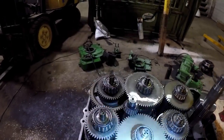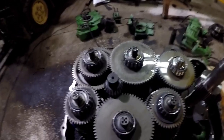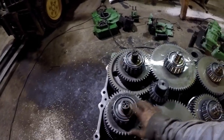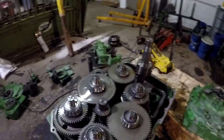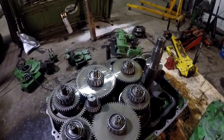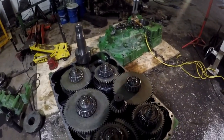If not, I've got an idea. I could make a - I've got a big piece of four by eight half inch plate. I would measure all these off and make a plate that would sit down over all the male ends of these shafts. Then I'd build a latch that would go right in the grooves right here. I'd tighten the latches down on each one and then put a lifting hook in the middle and lift all the shafts out at one time. This is a typical Funk transmission - Funk loves using tapered pressed-on bearings on everything. So our little bearing tool we made, we'll be pulling all those off and we'll change every bearing in it.